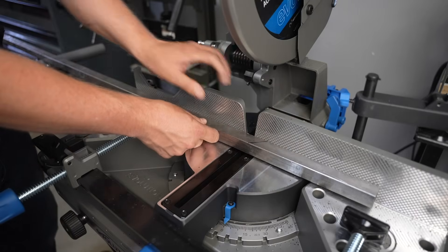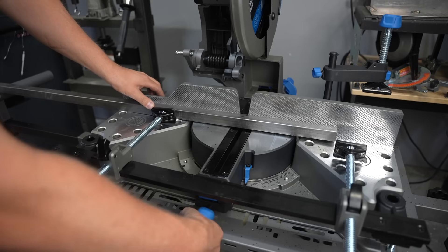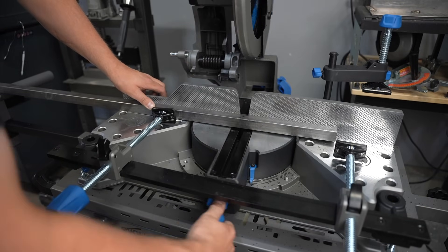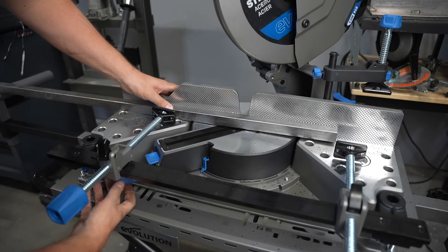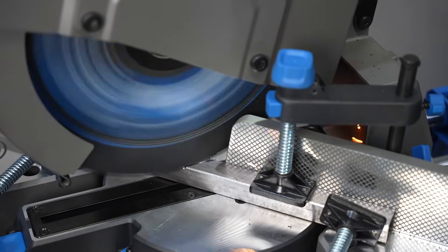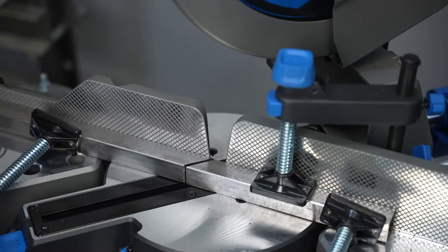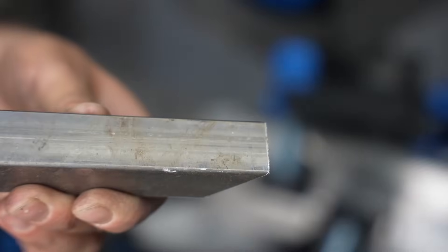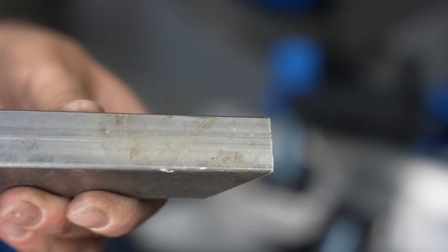Now I'm going to move to some thinner walled square tubing — some smaller stuff — and I want to make that miter cut. It's a one-handed adjustment for the angle, so I can loosen that and pivot the saw head either direction, and my material continues to face side to side so I don't take up too much real estate here in the shop. Cool to the touch as soon as the cut is made. Cut quality once again really nice. On the back edge there's a tiny little burr, but you wouldn't need to remove that in most cases, and if you did it would be really fast.